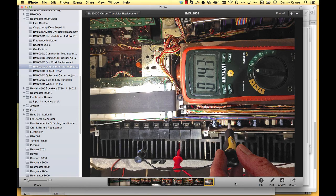Here we finally see how this adjustment is being done. I connect to the brown and red leads, and here I have my now fully insulated screwdriver. You also see I put some cardboard in to make absolutely sure that this will not happen again. I adjusted here to 14.4 millivolts — it was sort of fluctuating; it's pretty difficult to adjust very precisely with this single-turn potentiometer.